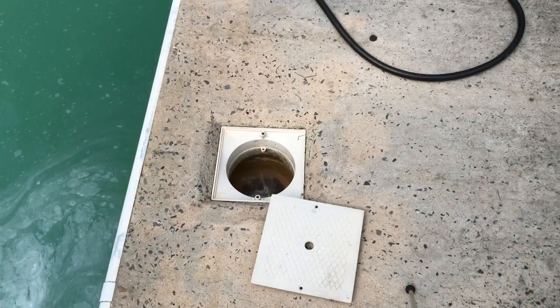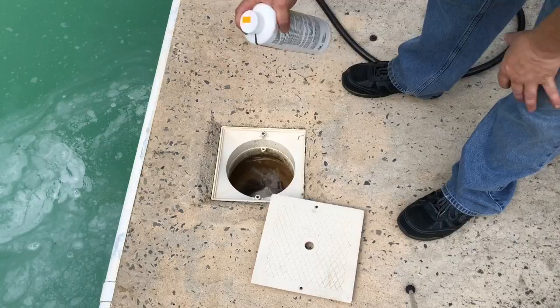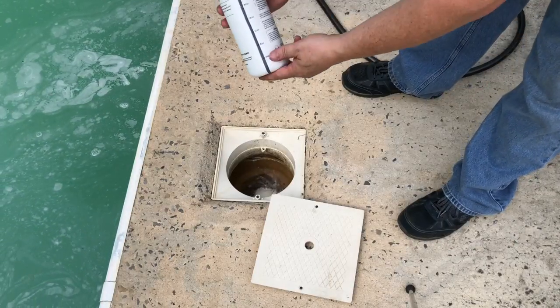With this product, for a moderate or mild cloudy pool, you want to use 8 ounces per 20,000 gallons of water. For a really cloudy pool, you want to use 16 ounces per 20,000 gallons of water. This is a 30,000 gallon pool — right at it, I believe it's around 27,000 gallons. So I'm going to have about 8 ounces left over. This is a 32 ounce bottle; we're going to put 24 ounces in it. You want to add this directly to your skimmer on recirculate. Shake the product really well before adding.